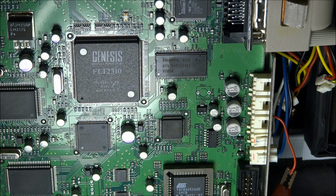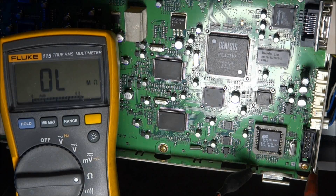Yeah, it certainly looks like the very top one is defrosting. Yep, there it is. It's a very quick change. So it is defrosted. The other 2 capacitors down below it are still frozen looking. There they go. Okay, so I'm going to take that capacitor out of the circuit, and we'll try it again and see what happens. Alright, so I went ahead and replaced that capacitor.